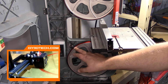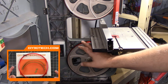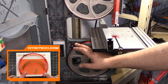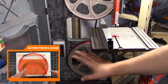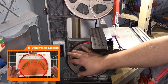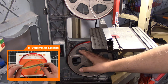The belt rides on this, and I measured up the pulley. One thing to keep in mind if you have one of these: there is a little bit of a lip on mine that keeps this wheel between the two lips on the pulley. Getting it on is a little bit tough — you really have to stretch it. I didn't show the installation because I invented a few swear words in between. But it does go on. You basically put it on and use a screwdriver to pry it around — if you've ever put belts on cars, you know how this works.